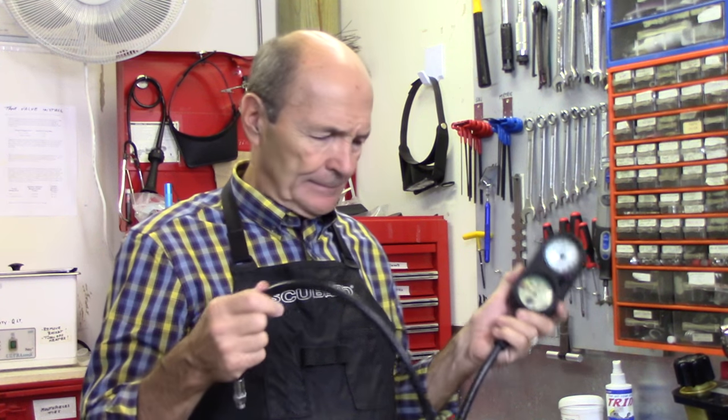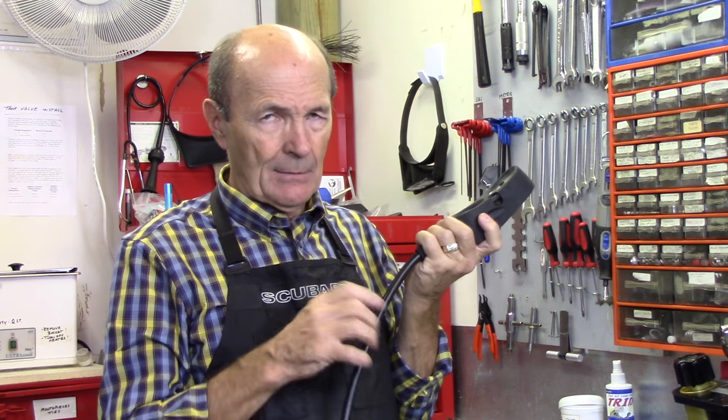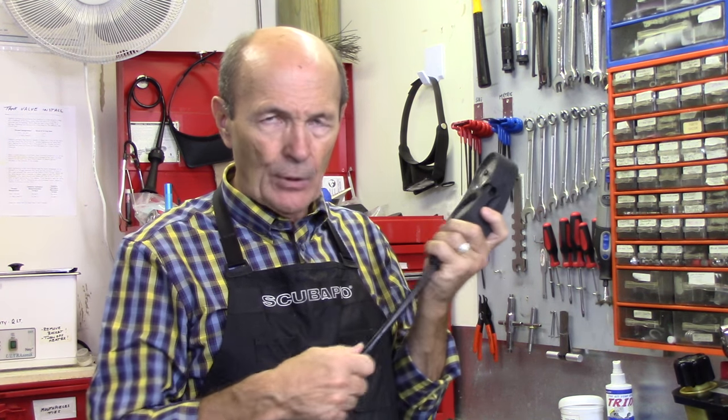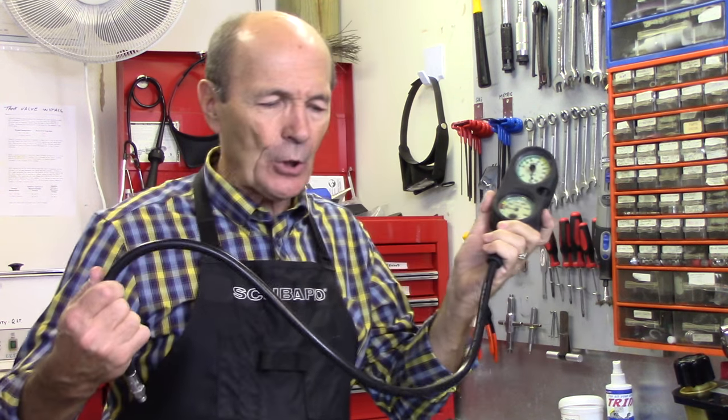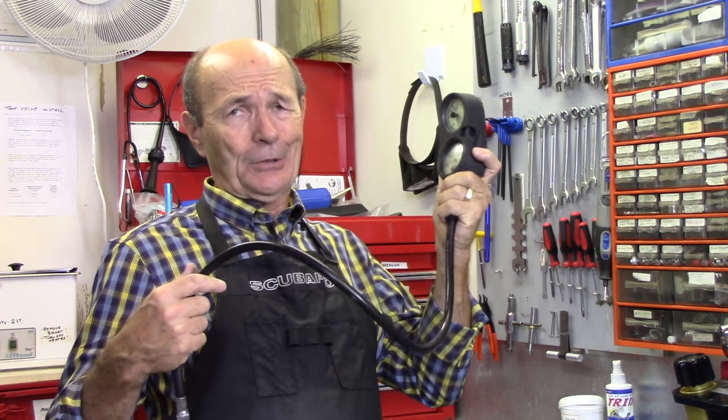The third reason why they make that inner tube very small is this. It can happen that this hose will break, okay? If this hose breaks while under high pressure, air will rush through this hose to come out of that hole, or if it breaks entirely, it'll rush to come out of there. And you have the same effect as a garden hose. With a garden hose, you turn the water on and you drop it on the ground, let go of it, and the hose whips around. I've seen this happen with a high-pressure hose. It breaks and the end whips around, and it could actually hurt somebody. Somebody has to get in there quick and turn the tank off somehow. This hose could actually become dangerous.